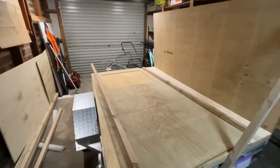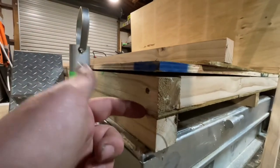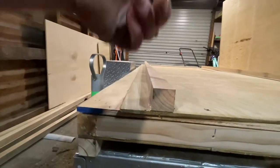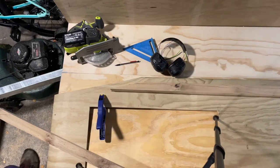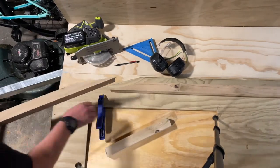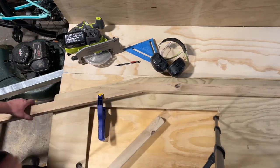I'm framing out the walls and here's where it gets tricky. We've got this height here from the top of that spacer up. I want the wall to come down and cover that ply — from the underside there to the top is 65mm. The interior floor is here and that is going to hang down the side of the trailer. I've cut the top face of framing so that the roof supports can fit in there. The off-cut will fit perfectly like that, giving you that same distance the whole way down, so you only have to make one cut for each side.